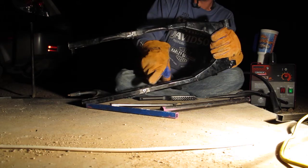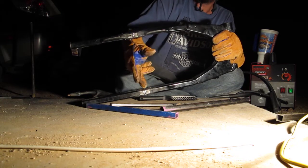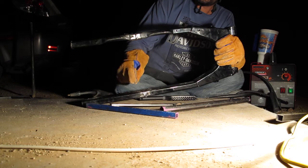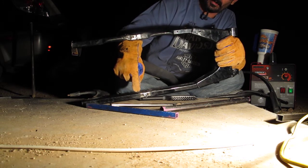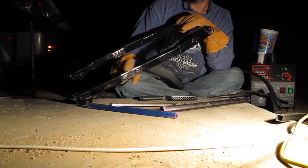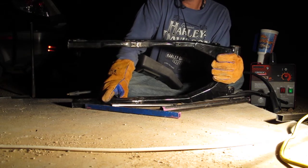For rosettes, I have a steel slug in here that I put in to hold everything together. I ground the ends of these down to a valley so I could get down into the slug, and I kind of started my bead there and melded the tubes to the solid slug. Then for the rosettes, I start in the middle of the hole, start building a puddle, and just kind of work my way around — building a puddle that's melded to the slug and then welding it to the actual tube. That's my strategy. I'm going to leave these as they are, as ugly as they are, and see what happens — give it some stress.